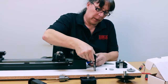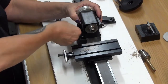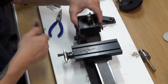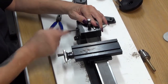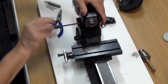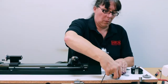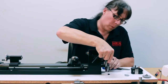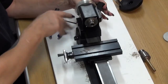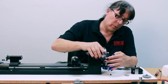Then we just go back on once we put the headstock riser block in. You have to make sure you get it where it's snug enough, but it still rotates nice and smooth in both directions.